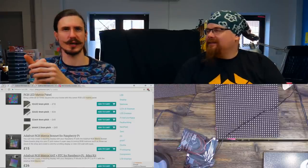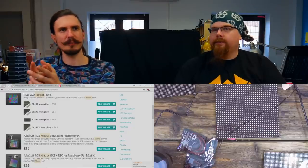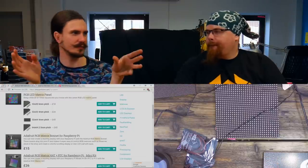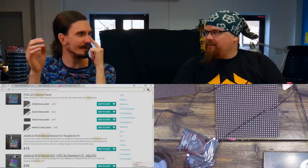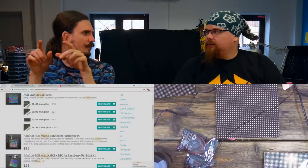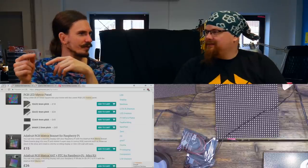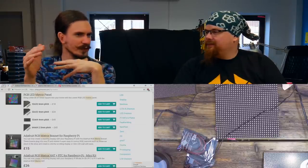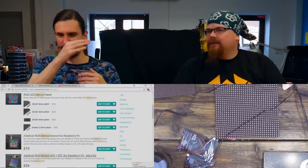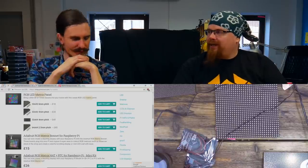You can do it through SPI using the same technique of specially formatting the data. You could do it through the PCM hardware, using the same technique as is done through the PWM, because PCM is effectively PWM, just slightly different in interface. And you could also do it, according to Gordon Henderson, through the UART by just outputting the data, timing how long it takes to output, and if that falls outside of a certain range, doing it again and again until you get the signal right. So you're timing the summation of your signal. I don't know how well that works. So there are various ways the Pi community has said, hold my beer.